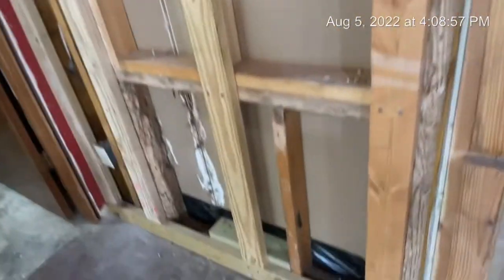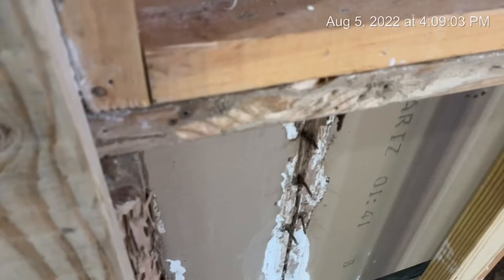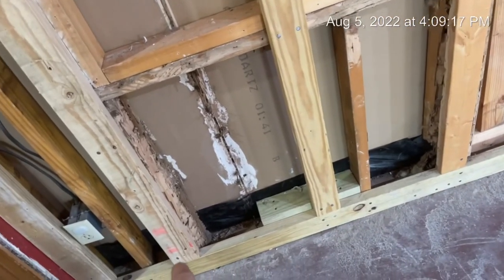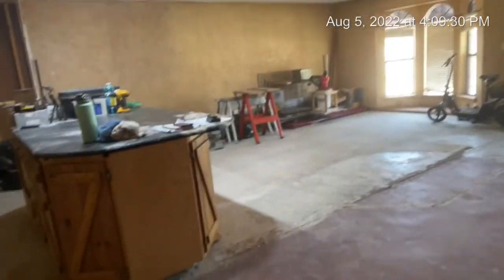I'm gonna get my permits and stuff. Remember that stud going right there — I put a little 4x4 block in there and just nailed it in. That to that is 16 on center, but that to that isn't, so... about as good as I'm gonna get on it. The space is all cleared out — I love it. That's it for now; I'll update you when I get somewhere else significant.